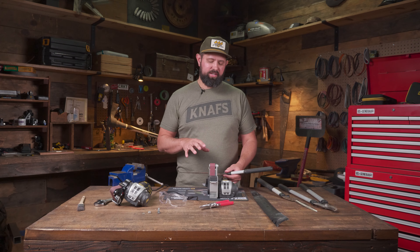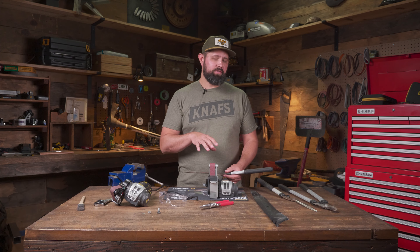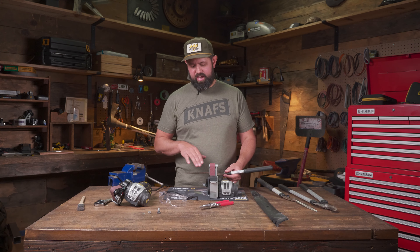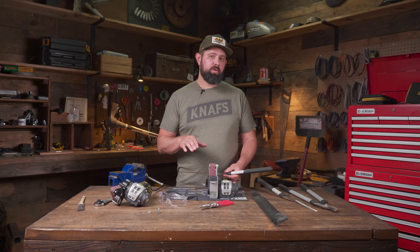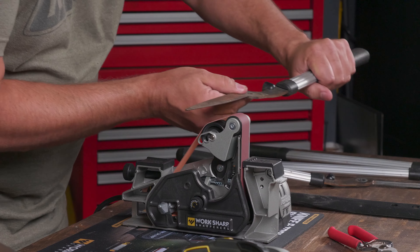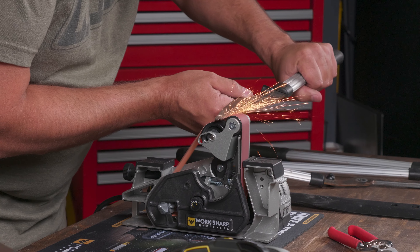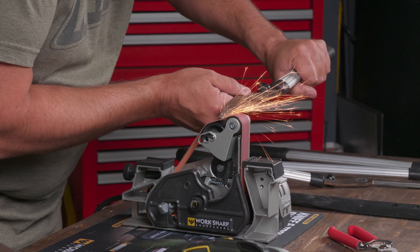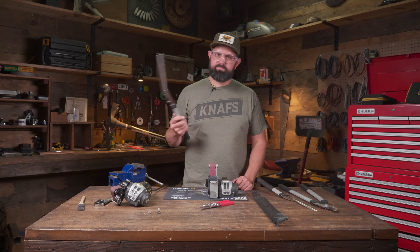Now that I've got these shears broken down, I want to make sure a couple of things are set up on the machine. I'm trying to achieve as flat a grind as I can on this edge, so I want my pulley in the furthest forward position for a flat grind. I'm also going to want to remove some material quickly, so I've got my speed set to six. With that set up, just like with any knife, present the edge to the belt and make consistent movements across to get a nice keen edge. After you've done one side, just do the other.